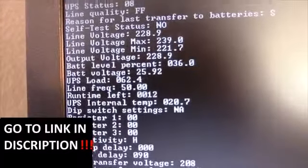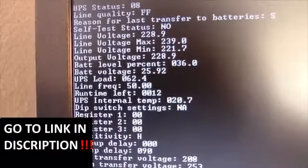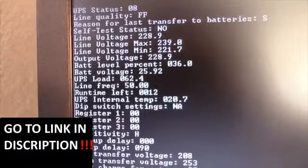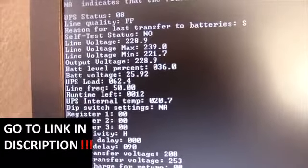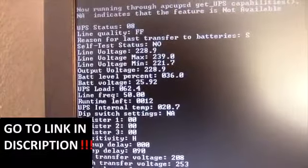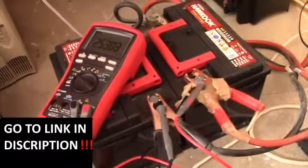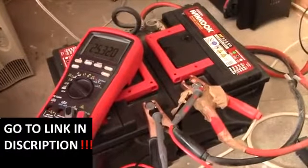Talk about disappointment - these batteries don't seem to be in quite as good shape as I had hoped for. It ran for about 10 minutes and then just quit the self-test. The battery voltage dropped to about 11V during that time. It seems I've got some work to do with these batteries because I think they've gotten a bit lazy over the years. But maybe we can do something about that.